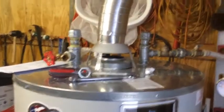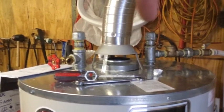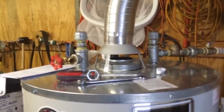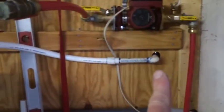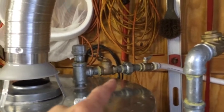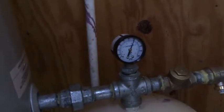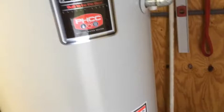I've got an expansion tank just for safety purposes. The system is closed — there's no water circulating out anywhere, but there is water coming in from my well and there's a check valve that makes sure the water doesn't flow back in that direction, and that's what keeps pressure on the system. It's at about 60 psi and the well can cycle up as high as 70 psi.